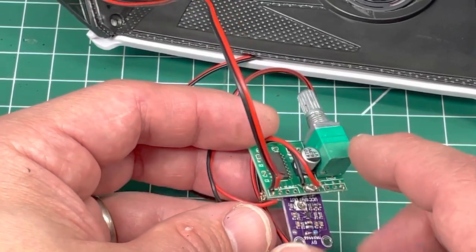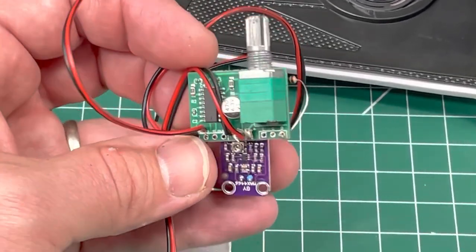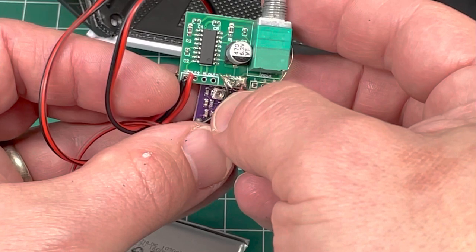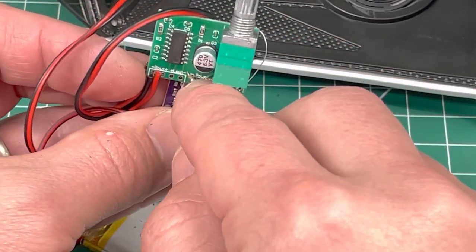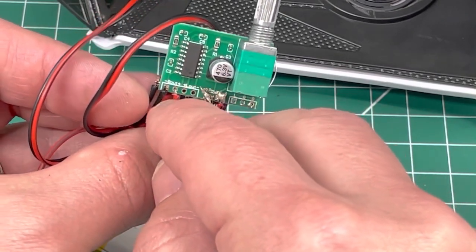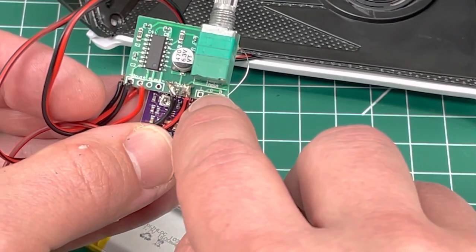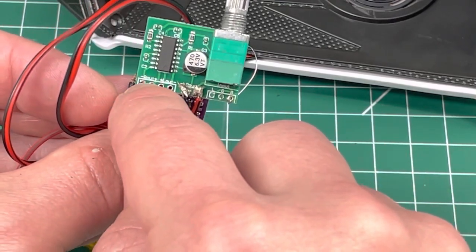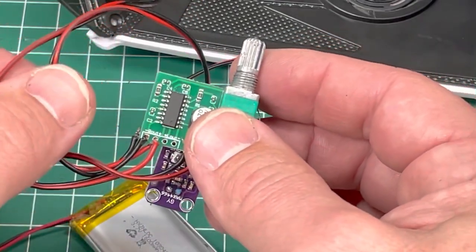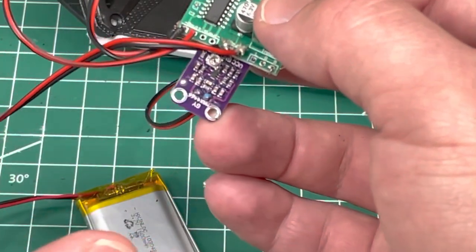Power comes into the amp board — it's well labeled. I've been moving things around so much that I kept breaking wires off testing different things, so the solder's not looking very clean right now. But it's got positive and negative all labeled. Regarding the right out, this is where my speaker comes out. Because I'm feeding into the right-hand side, it's labeled B but really means R — left ground, right. It comes out the right speaker portion of the board, which is where I have the two speakers linked in, soldered front and back. It was a bit of a butcher job just to test everything out, but that's what worked for me.